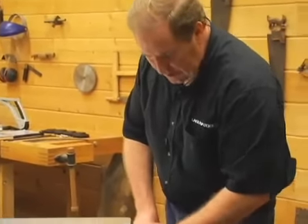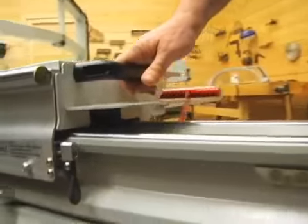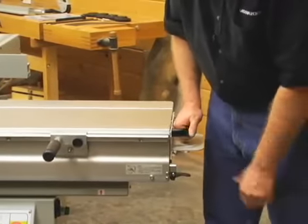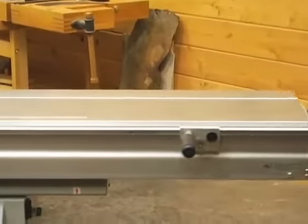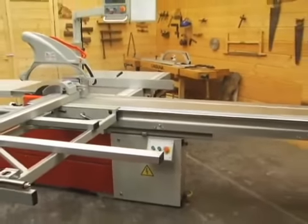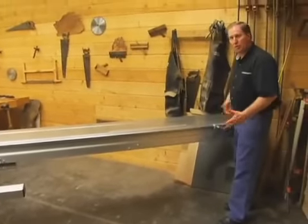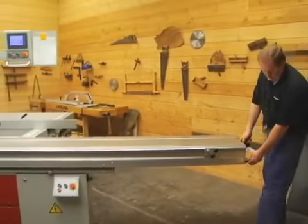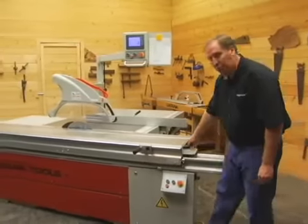You'll notice it has a lock on the side. This is the neutral position that's locked. To release it, I simply flip this down and I'm able to move the table quite easily. Coming back to that lock position, I flip this up and it simply locks in. There's also a lock out here — we call this a load lock. So when you're loading sheets of plywood and you bring this all the way to the loaded position, it'll lock in this position as well. You can load your sheet, unlock it, and slide it on. When it gets back to the neutral position, it'll actually lock. If I'm cutting sheets of plywood, I'll leave that down and slide it all the way through the blade.